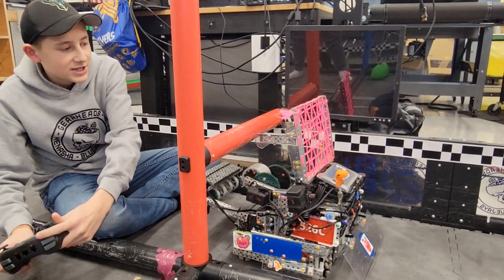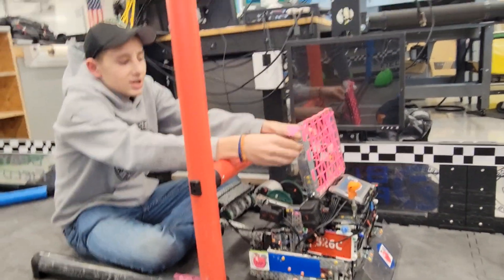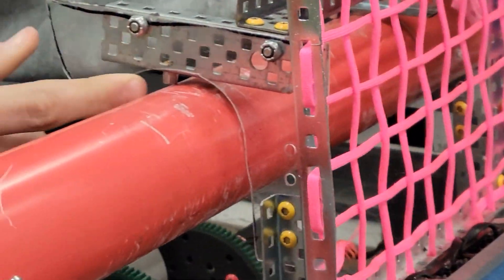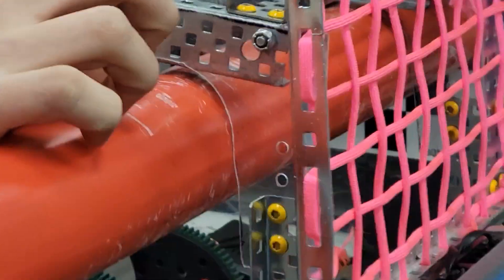I'm Mark from 526E RoboJuice, and I'm here to explain the hang and the blocker mechanism. With the hang, I basically just cut these plastic pieces that have a little ramp on them, so it kind of just ramps up the bar like this. And then these little tiny standoffs are there so that when it does go on the bar, it balances it and makes it stay in place. Otherwise, as you can see, the plastic isn't really fully touching — the plastic is mostly just to get up there. The balance was a little too low, so we added the standoffs.